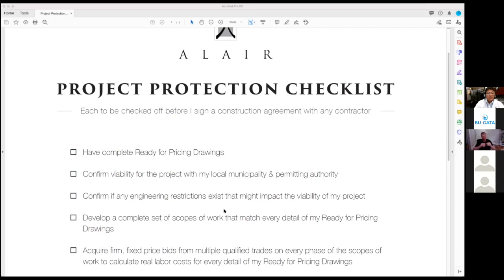So you have to have that full 7 feet if you do a basement. And that basement has to have a fire rated partition, a fire rated assembly between the basement and the upper floors. So if anything happens down there, it doesn't burn down the house, so to speak. So those are additional requirements. So a lot of times you have to bring more things into code compliance than not.